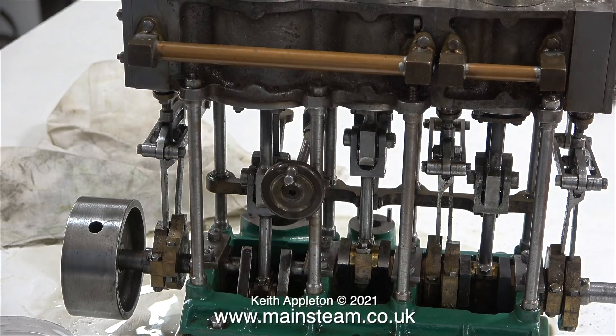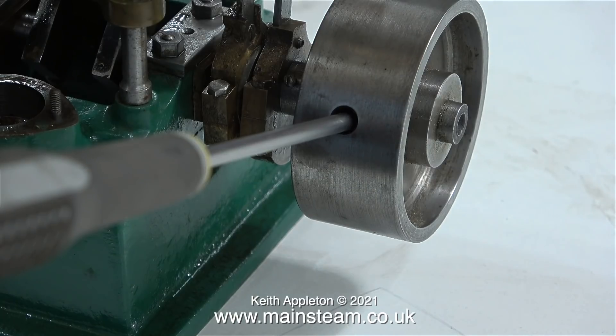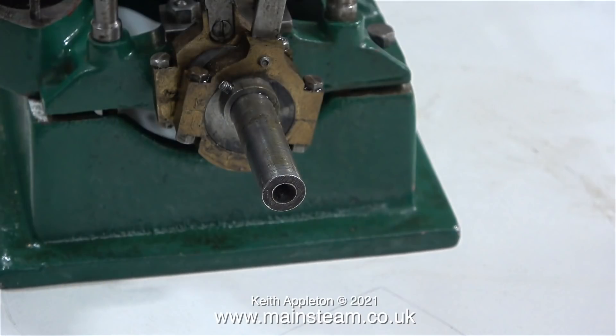Eventually it's starting to look a lot cleaner. Thankfully most of the engine parts are not rusty — this would have been a terrible job if all the parts were covered in rust. There is one thing that's bothering me, and it bothered me when I first saw the photographs: how far the flywheel is stuck out, perched right on the end of the crankshaft. I'm going to kill two birds with one stone — I'll remove the flywheel, which is secured with just one slot-headed grub screw. I will be changing all the grub screws on the engine for Allen cap-head type, including the very small slot-headed grub screws that secure the eccentric sheave onto the crankshaft. These nearly always break when I go into obsess mode setting the timing, and on this engine there are three lots of timings to set.